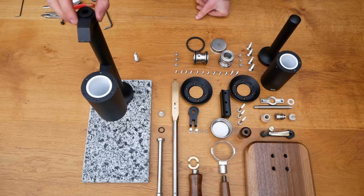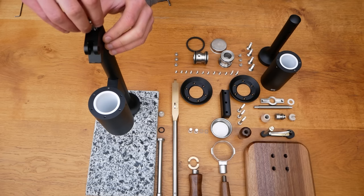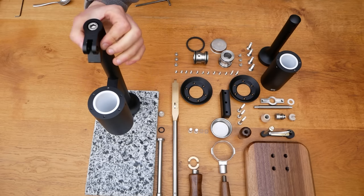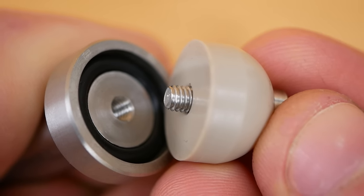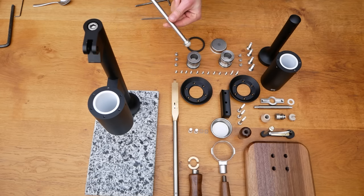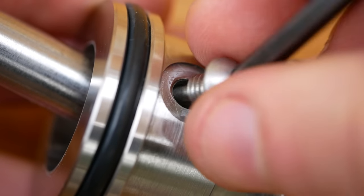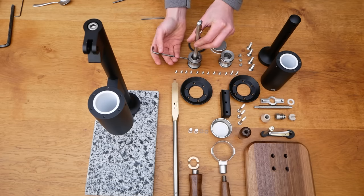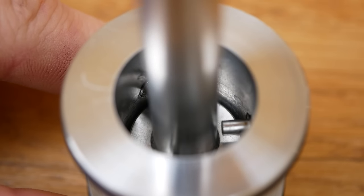This next block stops the handle on the Fulcrum machine from moving downwards too far, and the fork on the top forms the lever pivot point. One of the design features we felt was necessary was allowing water to be poured into the cylinder without needing to take the piston out. Since the coffee bed sits below the piston, we needed a way to allow water to transfer from above the piston to beneath it. We designed a non-return valve in the piston to allow this, keeping the system as simple as possible whilst allowing the same piston to be used for both the Fulcrum and the Helix. The non-return valve works by allowing a small amount of play so that when the handle is lifted, a gap between the hemispherical component and the piston opens, allowing water to rush through. When the handle is released the gap closes and a seal is formed. We have experimented with many different designs and this method works amazingly well.